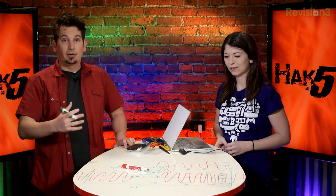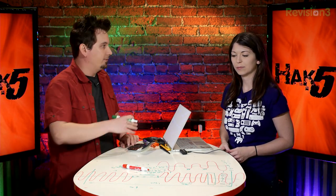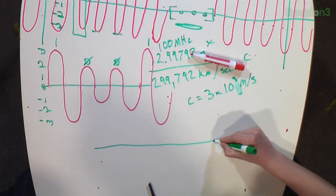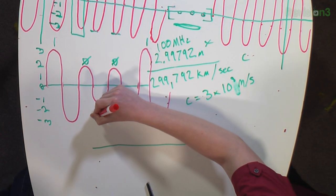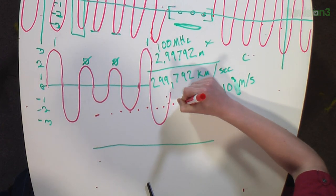Whereas another way to do it would actually be to modulate the frequency. So likewise, we can leave the amplitude the same over each cycle and rather modulate the frequency. For example, a low frequency could represent one thing, and a high frequency could represent another, but leave the amplitude the same throughout it all. So again, I'll just draw another one here. For this one, I'm going to cheat a different way. I'm just going to put a couple of dots across here to help me.